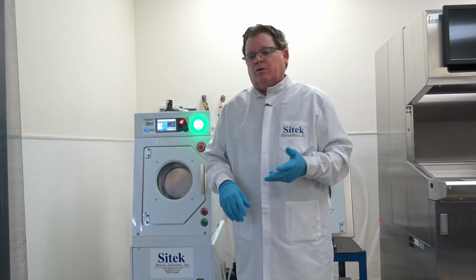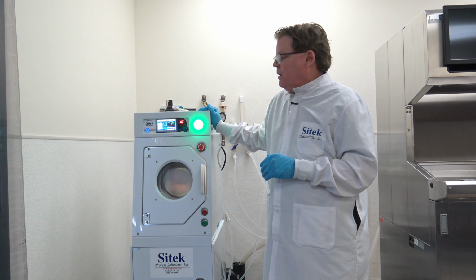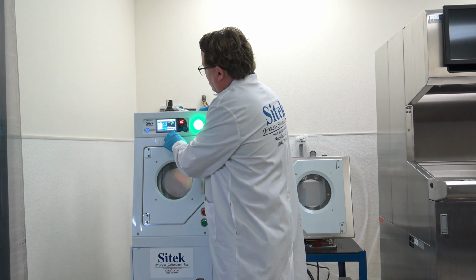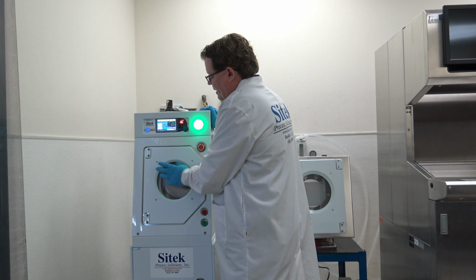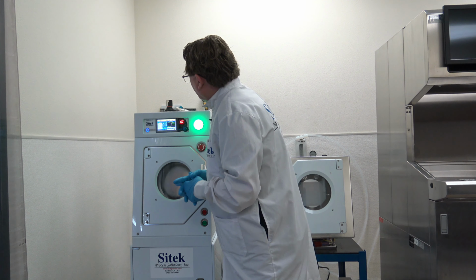Part of our rebuild also, you can't see it, but all of our pneumatic lines are color-coded, so they're easy to track. All of our wiring is labeled, so it's easy to track also. And all of our Teflon lines are labeled, so it makes it very easy for future maintenance. Right now, we're in a dry 2, which is elongated dry. It's using a low RPM with hot N2, heater blankets, a static eliminator on, and centrifugal force. So we have to run this for about 3 more minutes. So we have complete spare parts.